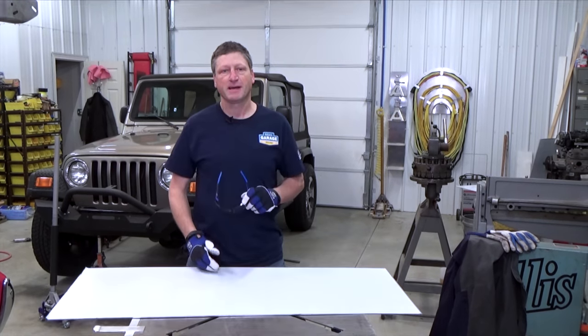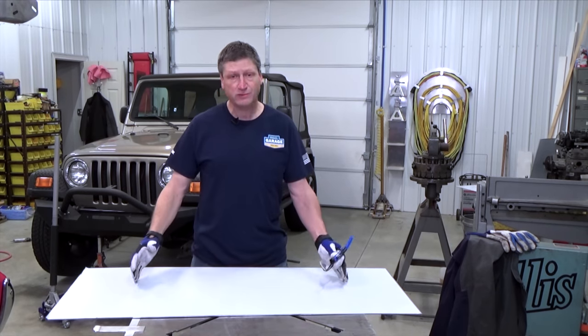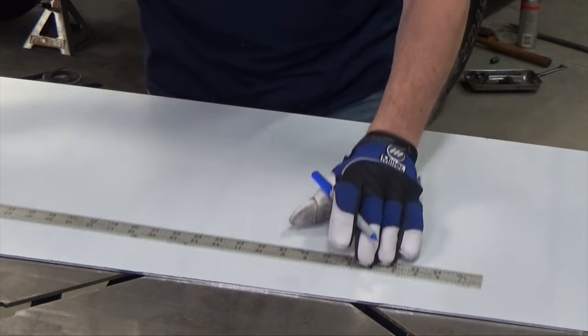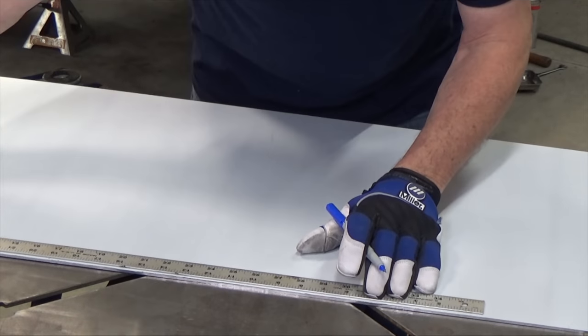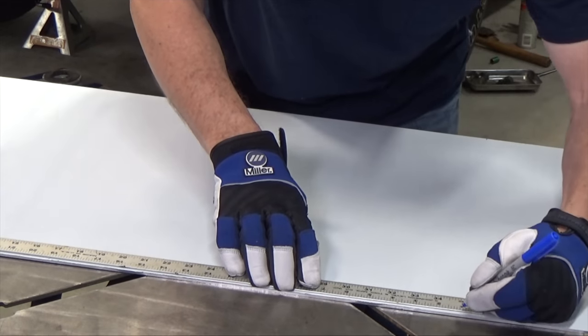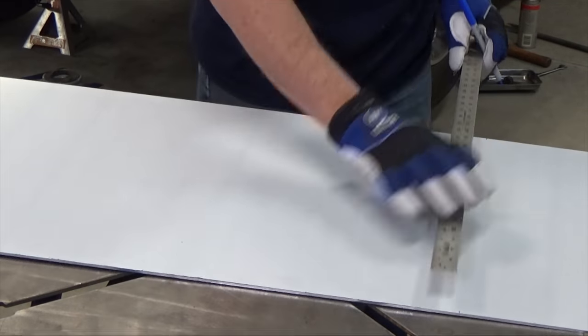Here's my layout. I plan on making my sheet cuts wide enough to get two sides and a top, and then bending those in my brake. Then cutting two separate sides and welding those on. You could cut all the pieces separately and weld them all together — it really only ends up being two more topside welds.